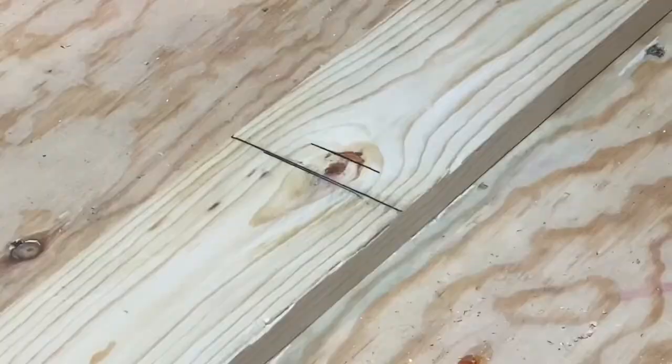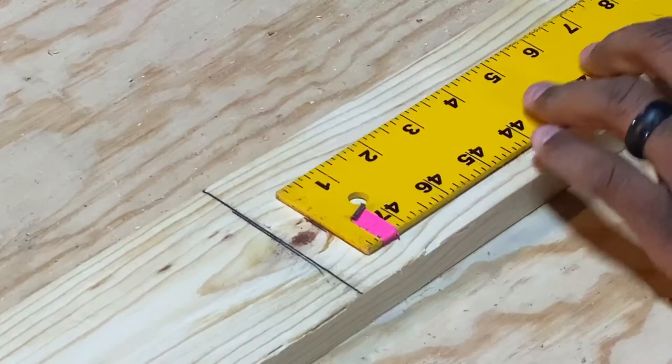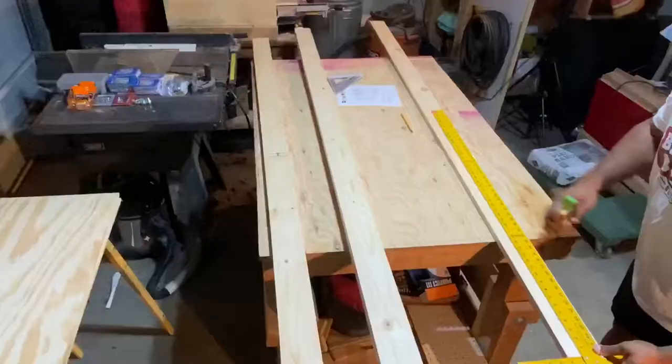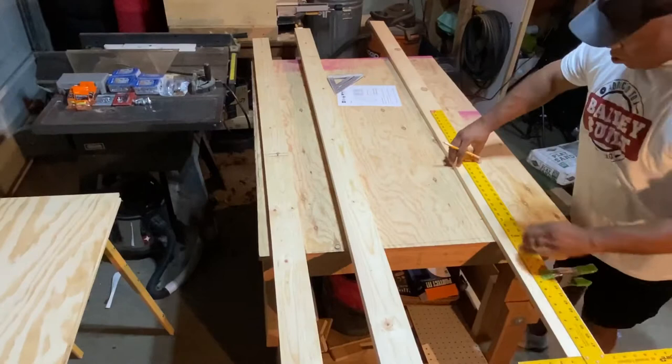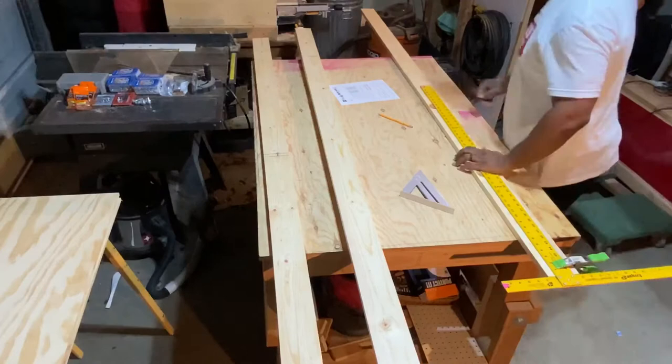These will serve as the four sides for your cornhole boards. The first step in this build was to measure and mark a set of 1x4s. The long side measures 48 inches, while the shorter side measures 22.5 inches. I like to use a T-square — this ensures that all my cut lines are straight. Clamping a simple utility clamp holds the square in place.